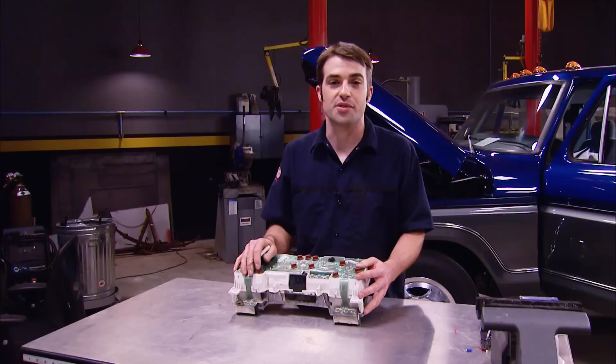The repair on this burned-up spot is definitely a little more aggressive — this is asking a lot of the liquid, but we'll see how it does. I'm probably being a little excessive here, but it's got to carry current so I'm going to give it the best shot I can. The repair is not the most aesthetically pleasing, but in this case it's definitely function over form. Less than one ohm of resistance — that's pretty good for a liquid. And just like insulation protects a copper wire, a little bit of clear packing tape will help protect our repair and give us the best chance at success.